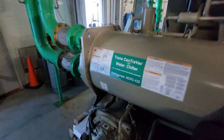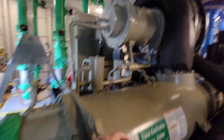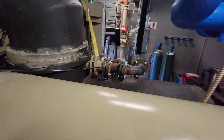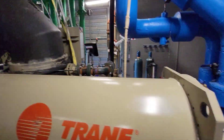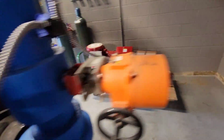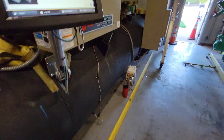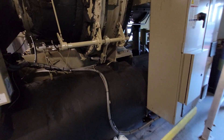Part of what I want to verify is hopefully this is dry enough to start — it's been set for quite some time. Oil level looks good. We've already done all the balancing and got all this back together. We're going to have an insulator come in and re-insulate once it's set and done. So far suction temps are staying up — that's a positive. We're still looking really good on our purge suction.